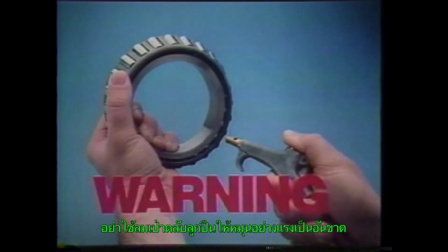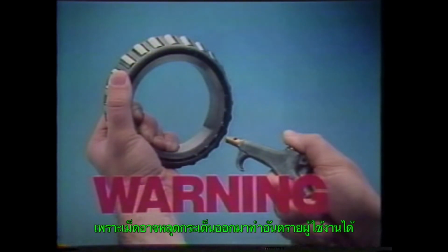Wear eye protection. Warning: do not spin the bearing at any time with the air gun, because the rollers may escape from the cage and fly out from the bearing, creating the risk of being struck.